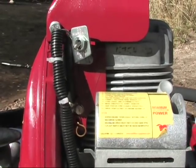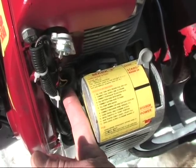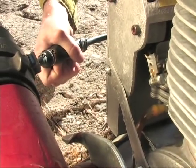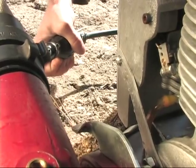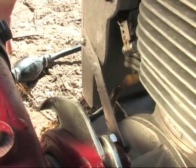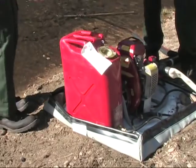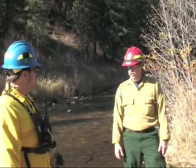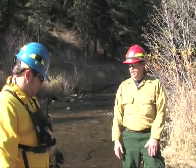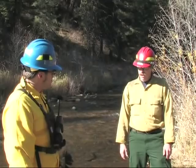The odds are the last thing this pump did was get turned off, so I'm going to make sure the ignition switch is up and on. I'm going to make sure the reset rod is in. Now I'm going to prime the carburetor — squeeze this primer bulb until I see the fuel in this hose just reach the bottom of the carburetor. We know we've got fuel. Is that fuel vent open? Yes it is. Is that fuel can lid tight? Yeah, that's tight. It's pretty cold, we should probably choke this thing. Choke just increases the amount of fuel entering the engine to get enough liquid fuel to create enough vapor for ignition. You normally do that when it's cold or hasn't been run in a long time? Yeah, cold starts only pretty much.